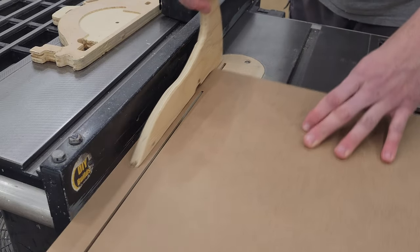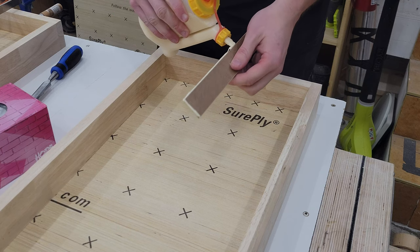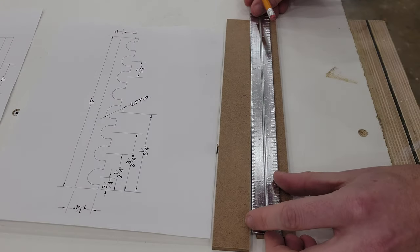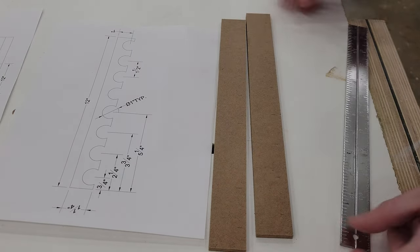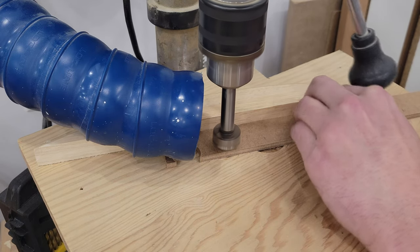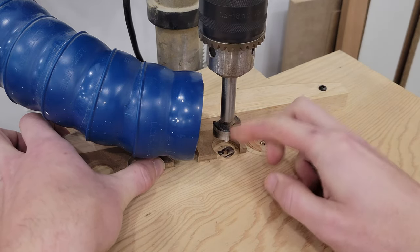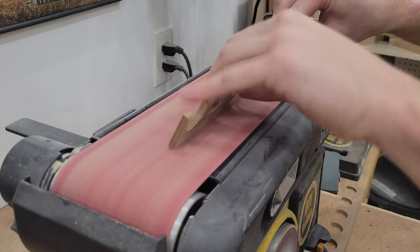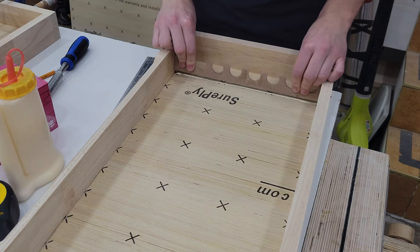I then rip four strips of quarter-inch hardboard to one and a quarter inches in width, then cut to 12 inches in length at the miter saw. The first two strips get glued onto the bottom front of each frame as they will retain the ring holders. The next two will become the hooks for the necklaces to hang off at the top. I mark out the center of each hole and bring them to my drill press where I have a temporary fence set up to keep the depth consistent across each hole. Then a quick deburring at the strip sander, as well as sanding a slight bevel on the back of each strip so they face upwards and keep the necklaces on a little better. The hooks simply get some wood glue behind to hold them in place.